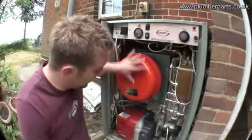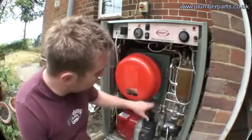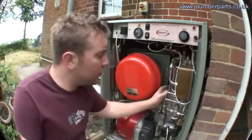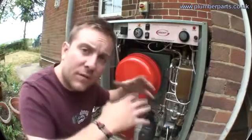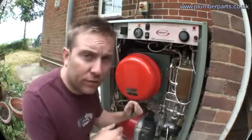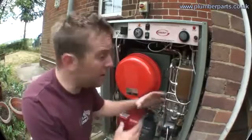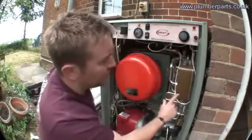Vortex has its main boiler system here. You've got your burner down there, your combustion chamber in here. Basically what a combi boiler does is instead of having a heating system with a big tank and maybe an indirect coil through it or a heating element inside, a combi boiler heats up the water directly using this bit here. This is a plate heat exchanger.